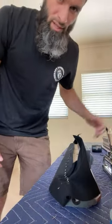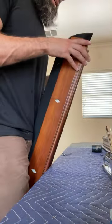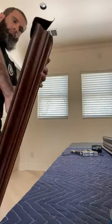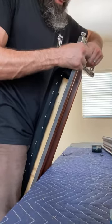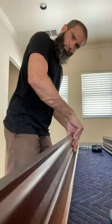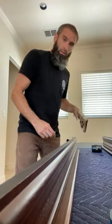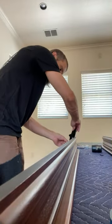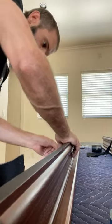If you put a staple in and it bends or doesn't go in, just take it out with your staple remover. It's not worth messing around with later on, because it's only gonna snag your finger and cut you, or rip your clothing. Same thing in the slate. If you don't take all the staples out when you're moving it, you're gonna scratch other pieces of slate if there's staples underneath and you're stacking them, or you're gonna walk past it and grab your pant leg and rip a hole in your pocket pretty good if the staples are sharp, especially when they're broken.